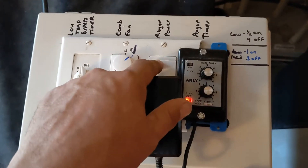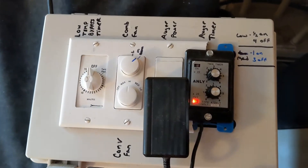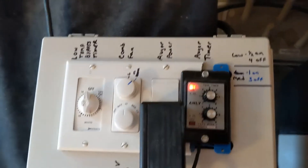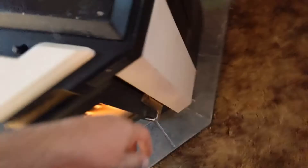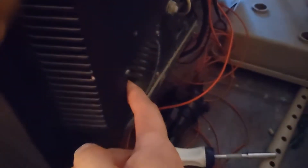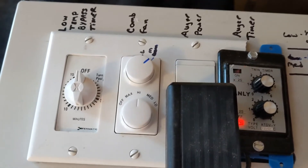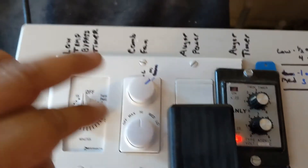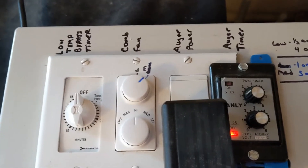Right now I can just turn it off with a fire in there, or I have to sit and babysit it. I can shut my pellets off and the fans stay running, but if I'm going to be gone for a couple of hours before I get back to relight the stove, I'm blowing cold air everywhere in the house and sucking combustion air off the inlet. My thought was to hook up another bypass timer so when I flick my power off it would keep my fans on through that bypass timer for a set time frame and then shut power off to those two.